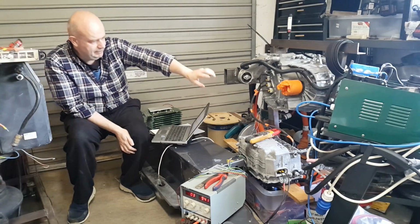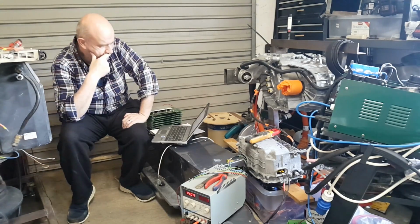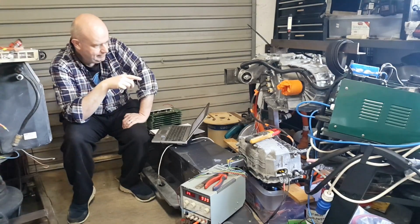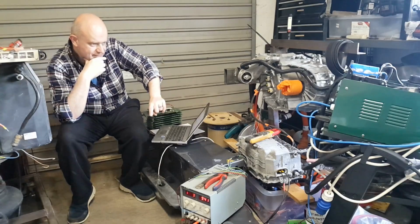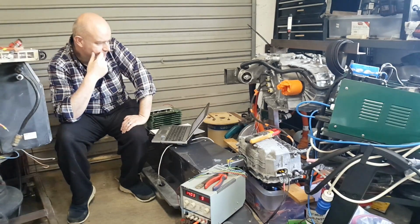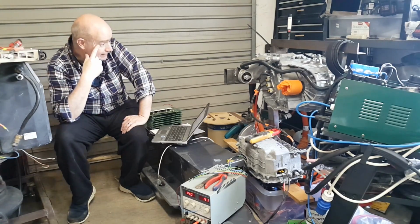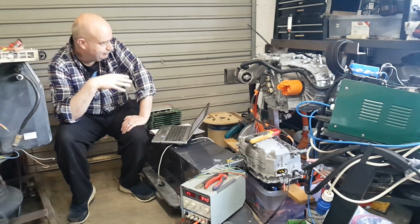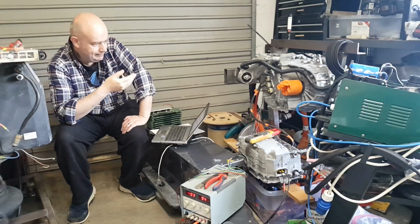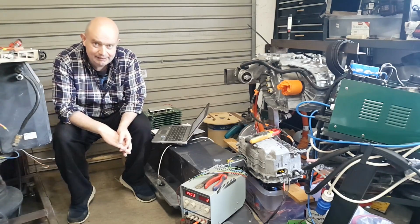I started playing with the clamp meter here, and when I was commanding manual ID into the motor, what I would see when I had the meter on AC was you would get a spike of AC, but then it kind of settled down very, very low, like 1 or 2 amps. So then I put the meter on DC, and I'm seeing massive DC currents going in here. Now, it's probably my ignorance to how all this FOC stuff works. But I said, okay, I did buy this inverter as being broken. So, has it got a bad IGBT in it or something like that?